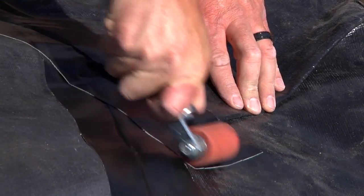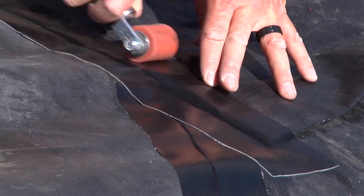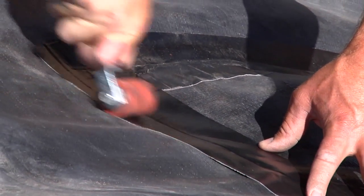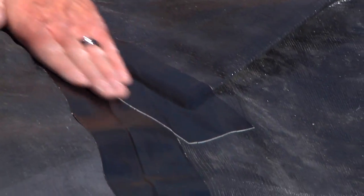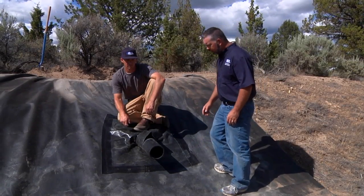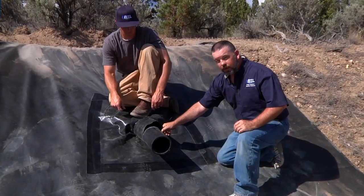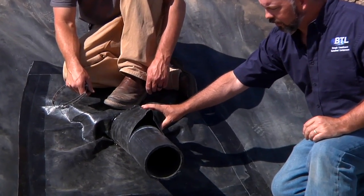As previously mentioned in the video, in a horizontal or a vertical boot, the dual tape method at the top of the boot would be unnecessary, and you would simply repeat the steps that you've done on the bottom and on the sides. You'll notice as we finished taping down the flange to the liner that the boot portion that covers the pipe looks to be oversized. It is done this way intentionally. We're going to show you how to deal with that in a moment.